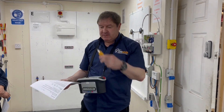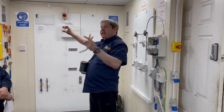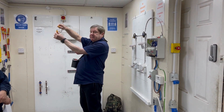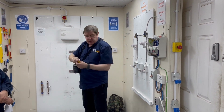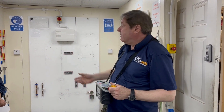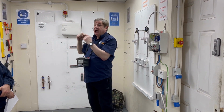Let's do the attached link lead first of all. Remember those two wires that go like this through the house — all the way through — and at the end we're gonna link them together, live and neutral. The reason being is when I go over here with the tester, I can test continuity, check if there's a low resistance all the way through. But if I took that link lead off and you got all that air in between, you've got high resistance and nothing will work.